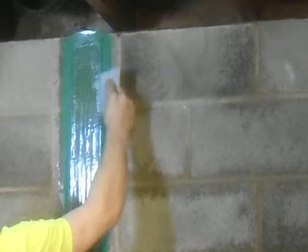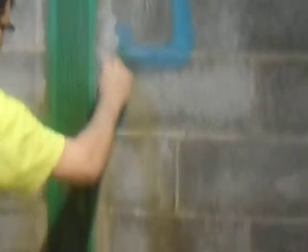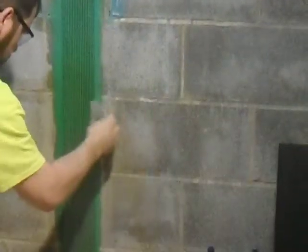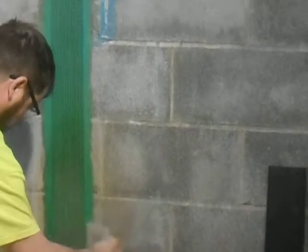With the clear cellophane membrane on top we can see any air bubbles that are left and we can push them out at this point in time. After 24 hours the cellophane can be removed and this grid strap can be painted with a primer, or you can scuff it up and paint it. Once it's cured after 24 hours you can also drill through it if you need to — it won't hurt anything, and you can anchor shelving or drywall over it.